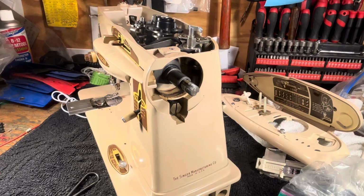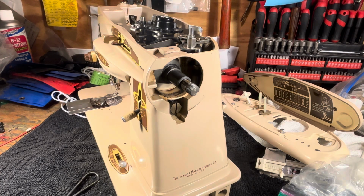Very little oil required. You can hear it starting to pick up speed. It's starting to sputter. I'm not sure how long this is going to be. I'm prepared to do another video. I'm not going to run 10 minutes sitting here listening, but I have run 10 minutes. Here it's picking up speed. What it's doing, it's burning off the oil that's on the armature and burning the oil out of the motor brushes. They're soaked with oil. And it'll burn them up. It'll recondition things to get back to 100% normal, but you have to be patient.